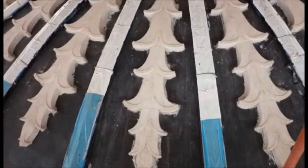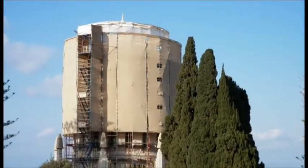The reason for retiling the dome was that the tiles had deteriorated to such a point that 99 percent of the gold that was originally on them had been washed off. So the tiles on the dome had to be all removed right back to the concrete structure. The dome was then re-plastered and waterproofed. The original tiles were a ceramic tile with a glaze, and the new ones are a porcelain tile — it's the same process as when you buy a porcelain plate with gold lettering or gold motifs on it, except these are a bit stronger — dishwasher proof and microwave safe.